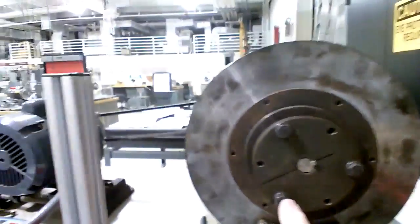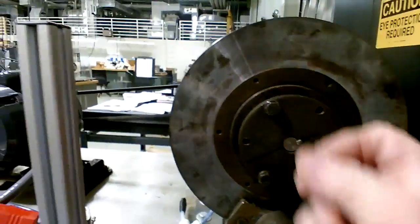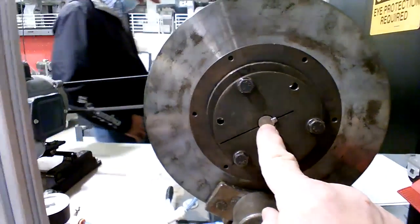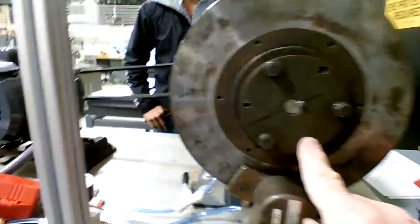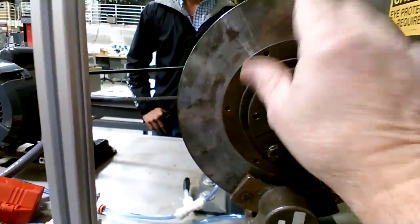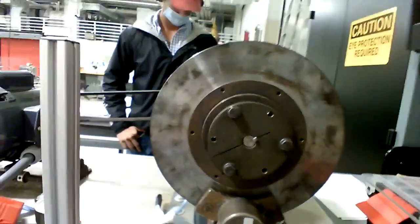And by the way, the bushing that's holding that rotor is a QD bushing. You have the three bolts that actually pull it together, that clamp it tight on that shaft. And when you go to loosen it, you got to move these three bolts into these jack bolt holes, and that'll actually separate the bushing from the rotor there. So that's the QD versus the taper lock. The taper lock is used on the sprockets that we had.